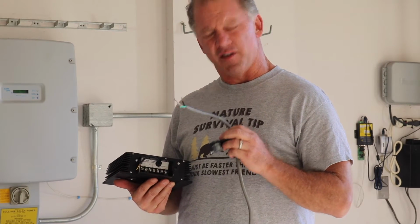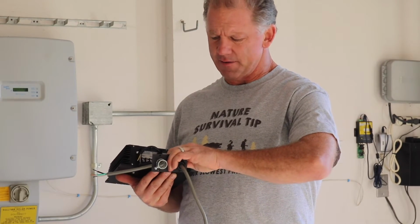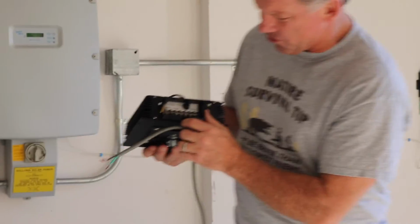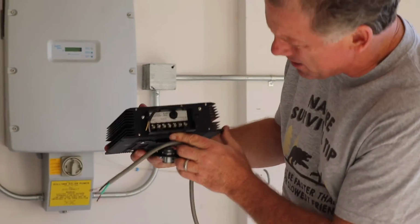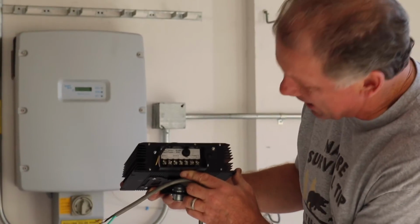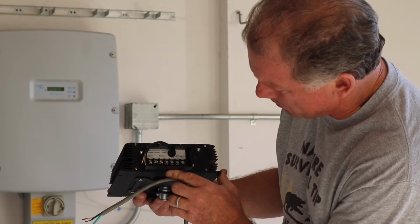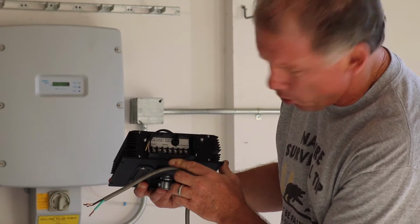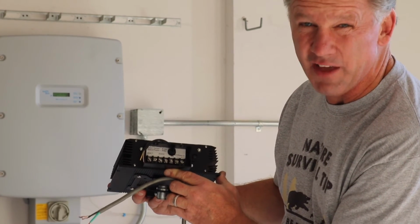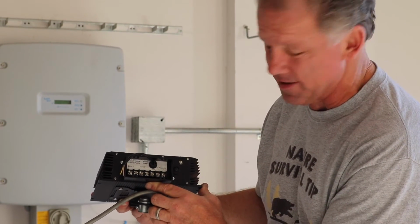So the way we've designed this is so that the left side of the frame has got power, and you can see, if you can just focus in on that on the inside, you can see that AC power is on the right side as you're looking at it, and the two zones are on the left side. Okay? The negative pole, or what we call the neutral pole, is always to the left of the hot or positive pole. It's well marked inside the dimmer, so you'll be able to see it.